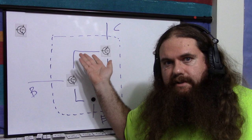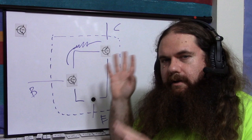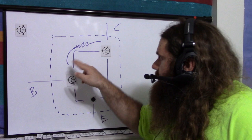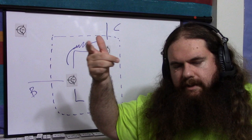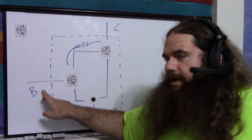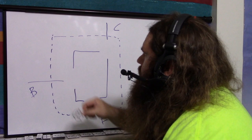You would have your pull-up resistor, just like before, if you need it. You can add all kinds of additional components to make it better behaved. This is the big one, especially if you're using digital logic. If you're using this as an amplifier in a common-emitter configuration, you might never turn the transistor off — you might have it biased to always be on. But if you're using it in a push-pull output stage, or for logic where it's on or off and you're trying to improve input impedance, that's the point — less current drawn means effectively higher input impedance — then you'll want that pull-up resistor.